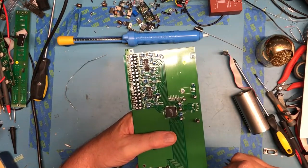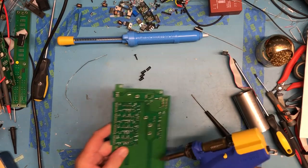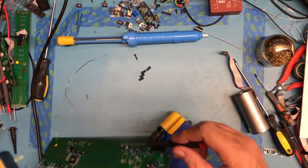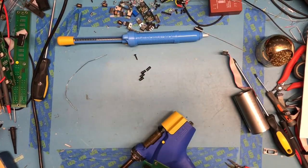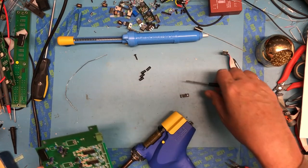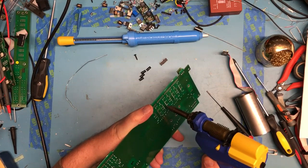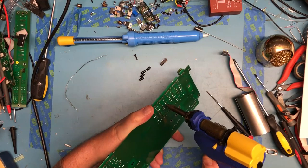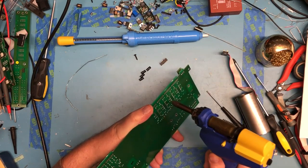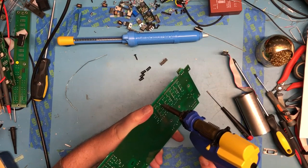Solder very well. There's one pin I can see that's still very much stuck. Whether that released it, I don't know. Just the volume of solder. Just a little bit stubborn. There's probably a ground here, based on the width of the copper, that's hung us up before. So I'll put a little more dwell time on that pin. That one doesn't look released.